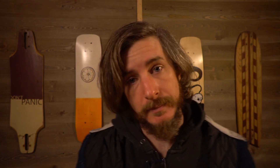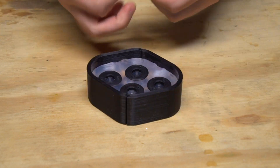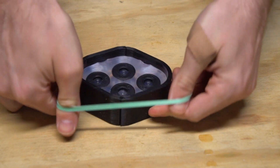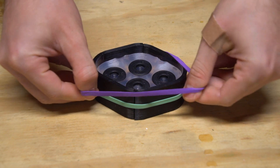With that, the first half of our mold is done. Let's move on to making the lid. To pour the second half of the mold, we're going to reseat the silicone in the mold walls, keeping those bushing bucks right where they are. Again, I'm using rubber bands to keep everything closed up tight, and the silicone will do a great job of sealing off the bottom of the mold this time around.